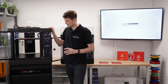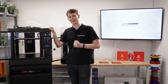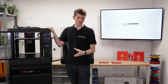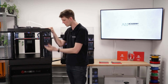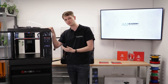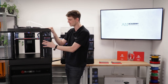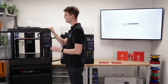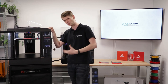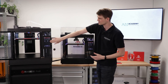On the display, if you have an E2 printer you already knew the auto-leveling feature, and you may also know video-assisted calibration. There are little videos integrated into the screen to help you through the entire calibration process — it will always tell you exactly what to do, what to do next, and what to wait for. It guides you through the Z-probe offset for both the left and right nozzle, and the X-Y calibration as well. Whereas before you would need the user manual or to teach people manually, now everything is included on screen.